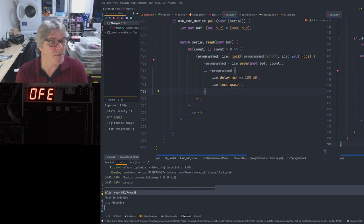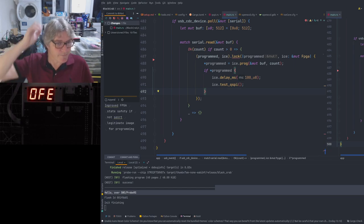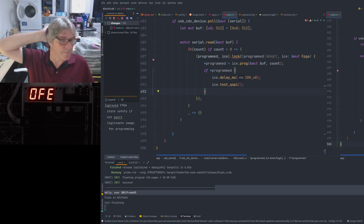Yeah, managing two cells is pretty easy. It's when you start moving up to like 4 and 8 cells that it gets really tricky and expensive from a battery management point of view. Also, you then have to move towards a more discrete MPPT type solution, because the current carrying capacity for doing the charging steps up quite a lot.